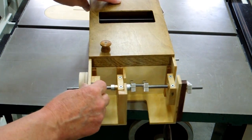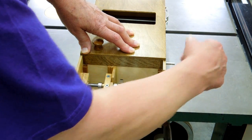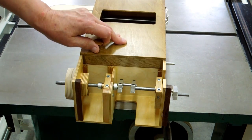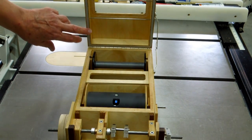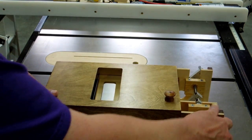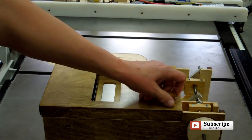Not a whole lot more to be done on the pressure box. It needs a latch on here to hold the lid tight. There's a rod that comes back here and pivots on the front part of the box — that's part of the clutch mechanism that disengages the drive disc so the take-up spool will freewheel. I also need to get those two discs mounted and the clutch mechanism completed. I put some thin rubber here — the kind the CNC guys use on vacuum tables to hold parts — and I'm using that for the lid gasket. Still need to put the two sides on, mount the bellows and reservoir, and I'll probably make the three large pipes first so I can get the drive motor positioned without interfering with any of that. And the tracker bar will be an interesting project.